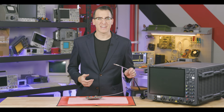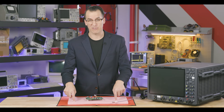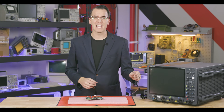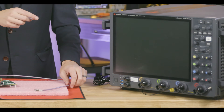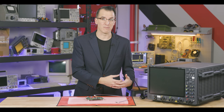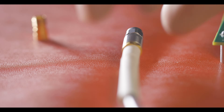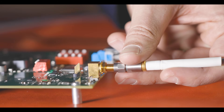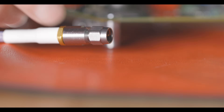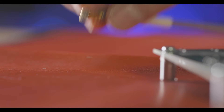It's not just boards you have to watch out for — your cables can also cause damage. Believe it or not, the center conductors of your cables themselves can build up a charge through induction from a board or surrounding fields. So to blow up your test gear, just grab a cable at random and connect it up to your gear without discharging it first. To avoid this damage, discharge your cables before using them. First, make sure your device is not powered. Second, connect one end of the cable to your device. Then grab the other end of the cable and connect it to a 50-ohm shunt, or use a short in a pinch.